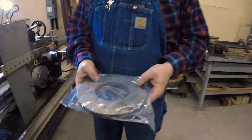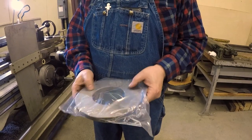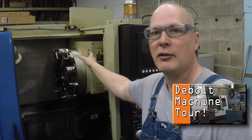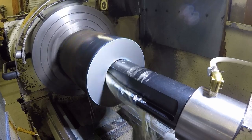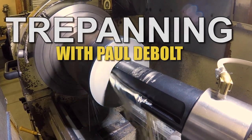We use these billets to make tramming rings — that's what this billet's for. We trepan that hole out, machine it, and put nice radii on it so you can lay it on your milling machine table and run your indicator around it without it skipping all over the place. Awesome — one of your Bridgeport-type mills. We'll throw a link in the description to Paul's website where you can buy those. And if you haven't seen a tour of his shop, we actually did a full tour of Paul's shop — it's a real wealth of knowledge. Paul, as always, thank you very much. Not a problem, John — come by anytime. Hope you folks learned something. Take care, see you soon.